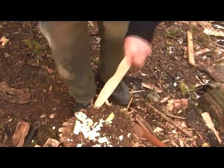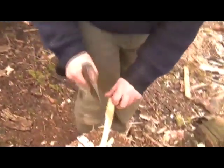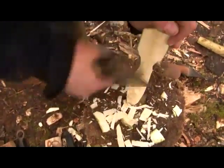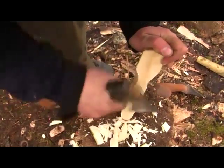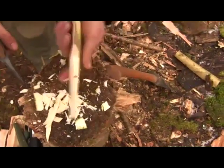You can see that I'm holding the axe choked right up the neck for more control. For a power cut you're holding it down here — more leverage. For more control, hold it right up the top in little cuts. If I look right down it I can see exactly the angle I'm going. These cuts I'm going with the fibers, not going across them. That's created a bit of a bevel on there.